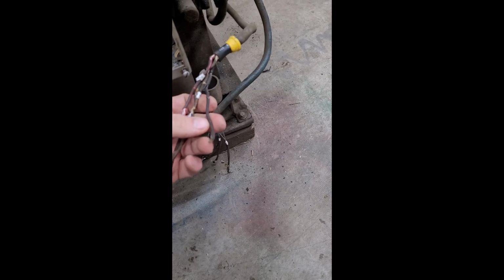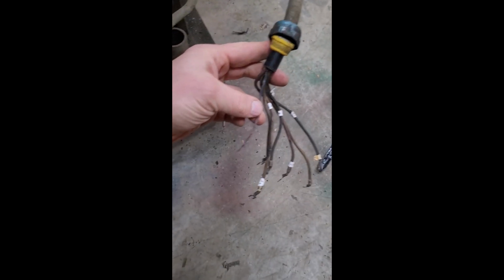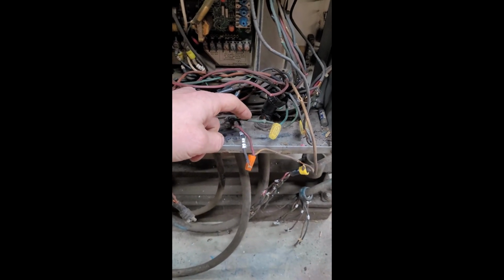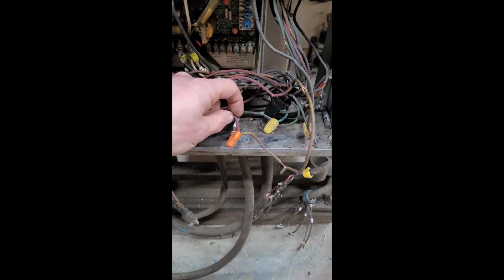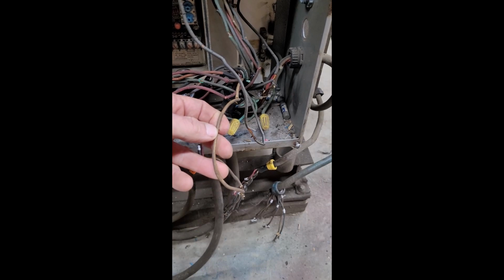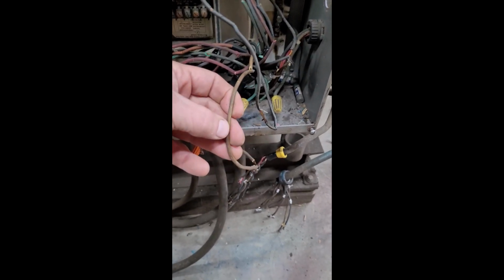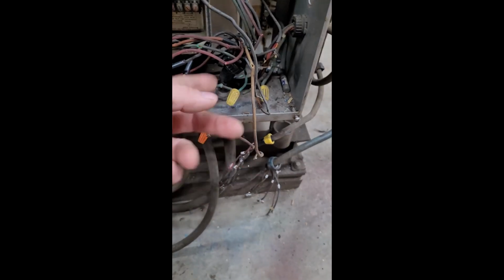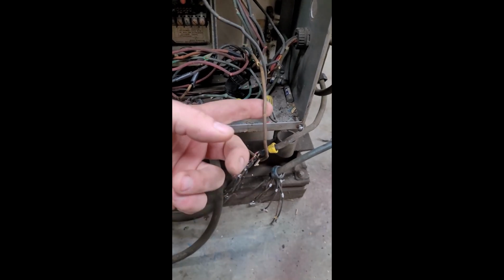of the other ones. So any of the wires over here that are not marked, which is just one wire, this one here is green, it goes to ground. And this wire here that's completely melted away, also ground wire. So I'm going to mark these wires here just as ground and ground. One comes from this 20 wire cab tire, and one comes from the foot pedal. This red one from the foot pedal goes to this, what I'll assume is yellow. It looks like a yellow with a black stripe. Anyways, I'm just going to mark it so that I'll have that same connection afterwards. I'll mark both the red and this yellow wire,